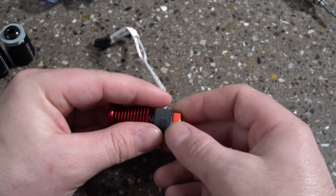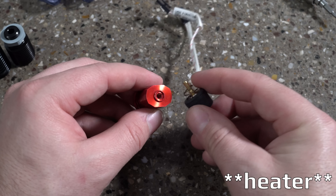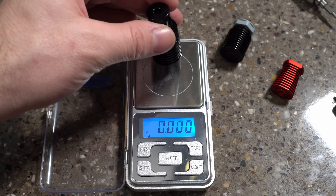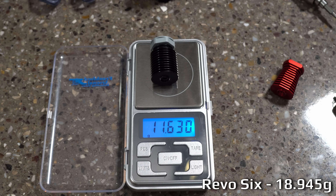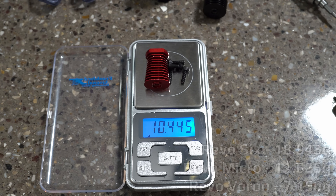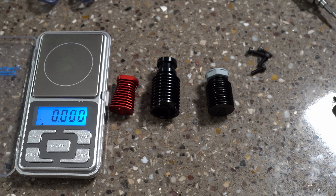Removing the hot side reveals the heatsink itself — flat on the bottom with a small detent for the spring to connect to. Comparing weights: the Revo 6 heatsink is 18.94 grams, the Revo Micro is 11.62 grams, and the Revo Voron is 7.15 grams. Adding four M3x10 screws for mounting — as required for the Stealth Burner — brings it to approximately 10.45 grams. It is the lightest heatsink available for the Revo.